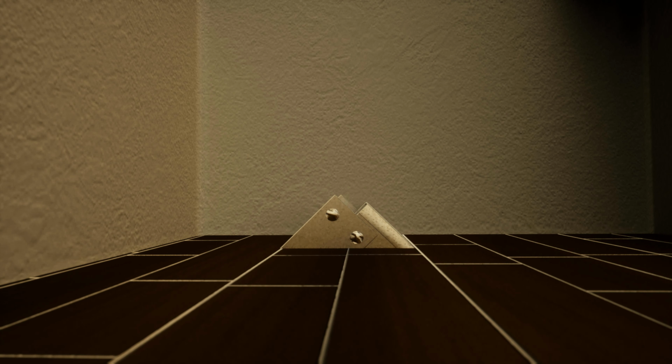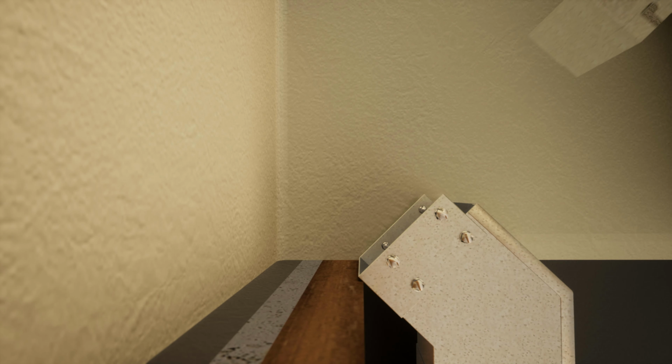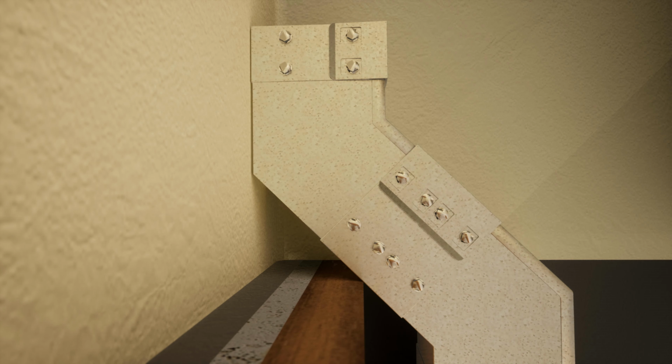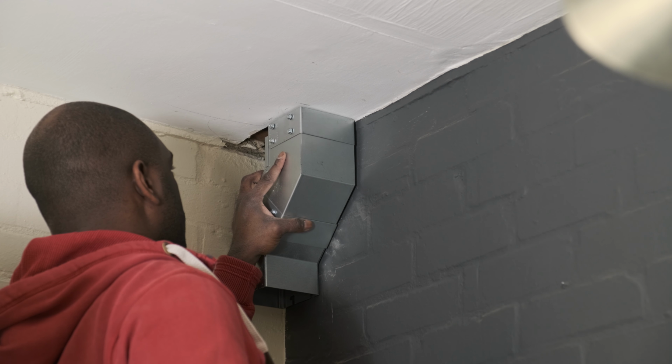The other thing is that, as I wondered when I first measured the house, the wall in the kitchen and the wall in the bedroom don't exactly line up. So I will need to extend the second offset by about 5 cm, which luckily is about the shortest length I can make and not have the coupler fittings get in the way of each other. This new plan means I need to cut the ceiling some more.